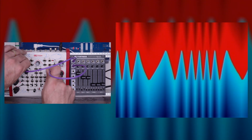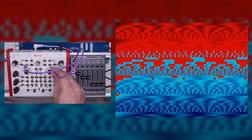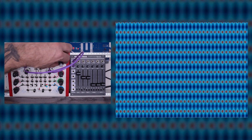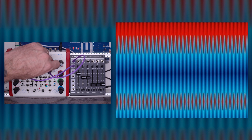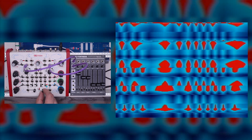If you cross these around the other way, oscillator 2 from the Fortress will be able to modulate oscillator 1 on the Vidiot, but oscillator 1 on the Fortress will not have as good of an effect on oscillator 2. This is because frequency modulation requires the modulating oscillator to be at a lower frequency than the oscillator you're modulating. So I'm going to go back to the original setup and start to adjust our different amounts. In the Vidiot, I'm using the keyer — this is keying the diamond pattern, the combination of oscillator 1 and 2.